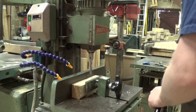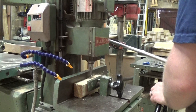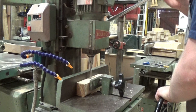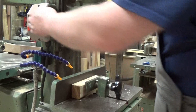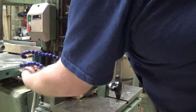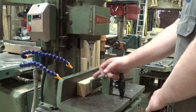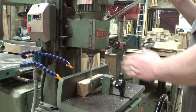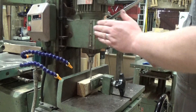The little air blower's on and away we go. You want to be taking as near as you can to a full portion of the cut every time. Then once we come near this end, slide over and do that end. When we come to the end of the mortise — you'll notice I've moved over and cut this end first. That's because you don't want to make your last cut as a half-chisel cut, because what tends to happen is the wood or the table tries to move that way, or the chisel will bend into the cut and you're not going to get a true square cut.